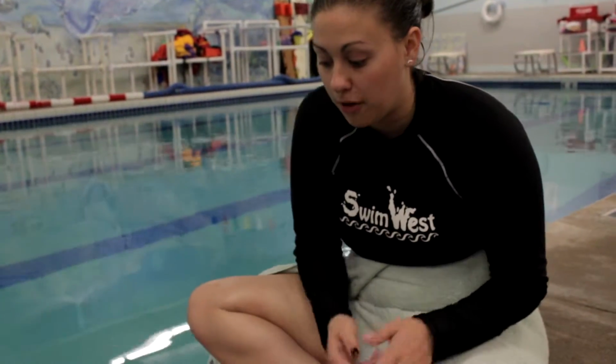It's pretty simple. And if our chlorine is at 2 or low, we need to let Karen or myself know, because it means it's probably dropping pretty fast. We don't want it under 1.8. Okay. So if it's 1.6, just let us know. Especially when you test chlorine and there's nothing. Too high level would be over 10. So legally you can have chlorine between 1 and 10. We keep ours around 2.4 to probably about 3.2 or 6 is usually the highest that we have it. Any other questions? And then you just have to write it down.